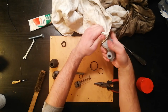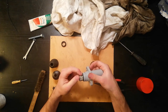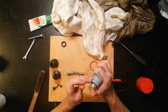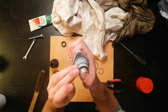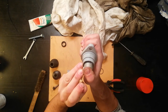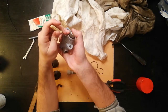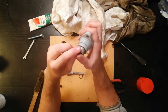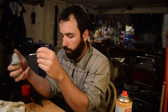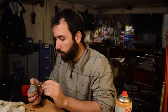Now the tricky bit — you have to put the piston inside the housing without the skirt flipping outwards, because it wants to flip out. You want to tuck it in just like so, then all the way around nice and easy. Don't press too hard with your thumb. On this side it's gonna flop. There's a notch where the clip lives, so be very careful when you push it further down.